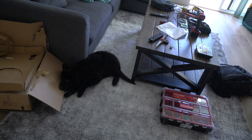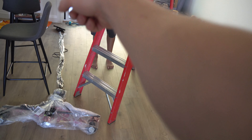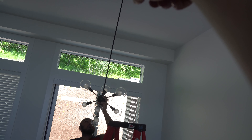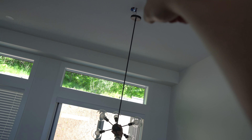Mika just stayed here and looked cute and ate the box. Now the next thing we're going to do is take this light off. You can see I've already undone the two screw ends there that were on the very top — the whole light's coming down. Next thing to do: take my impact, take off that metal plate, and uncap the white and black leads.